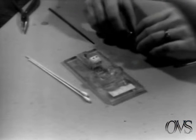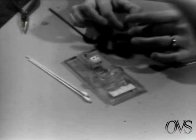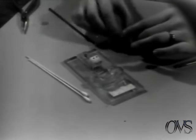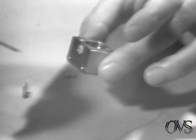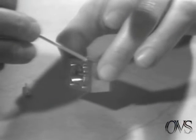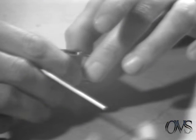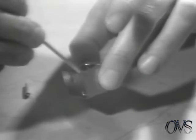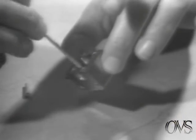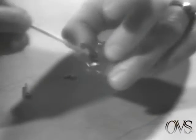Next we have the housing after it has been cooled and we've removed it from the heat gun. The bead supports are soldered in. We take them and wash them with soda water and soap and a brush, cleaning the surface well of the acid flux. We also check to make sure the bead support is soldered in well and the solder has flowed good.